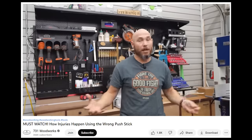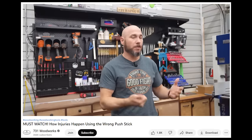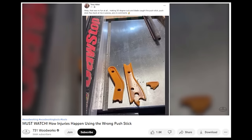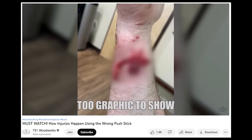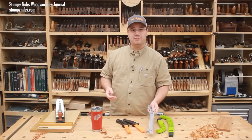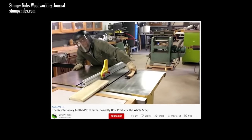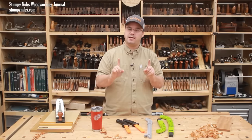It's proven that these things are wildly unpredictable as to what's going to happen when they hit the blade. The whole thing started with a social media discussion about injuries sustained when a plastic push stick made contact with the table saw blade and shattered, sending shards flying at the operator like shrapnel. This is a real thing. Cheap plastic table saw accessories — including feather boards, pusher paddles, and even push sticks — can get a little sketchy if they contact the blade.